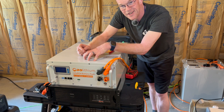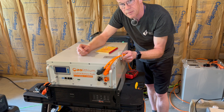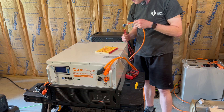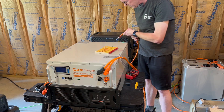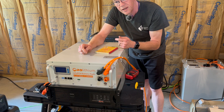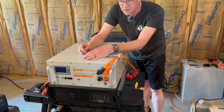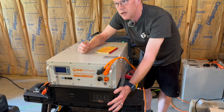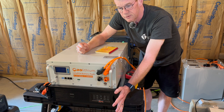Before I fire this up, I did have to make some cable adapters, and I put an inline fuse in it. This is the positive; the negative is taped and insulated. That is a 100 amp fuse. This battery is rated at 100 amps continuous, and this 2200VA UPS draws I think about 40 amps maximum, so we're in no danger.